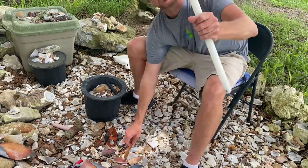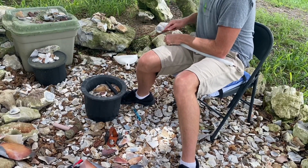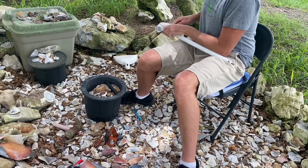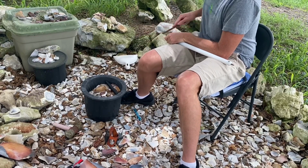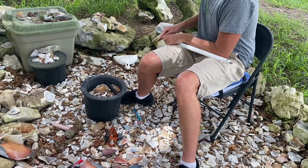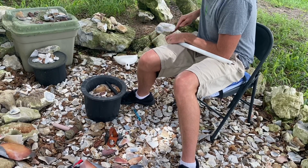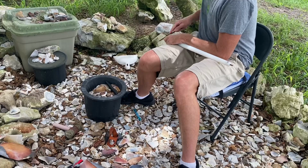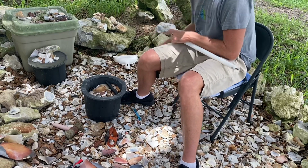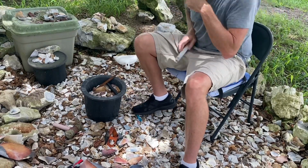One more thing, I'm gonna go ahead and sharpen this up again, because we've got even a smaller area for our platform now that we've ground this down, and our preform is roughly 1/3 the thickness that we started. Probably do a couple passes on this just to make sure I get that nice and sharp. All right, looks pretty good to me.